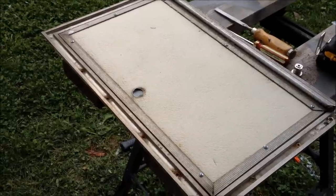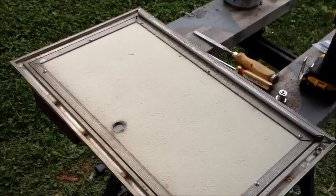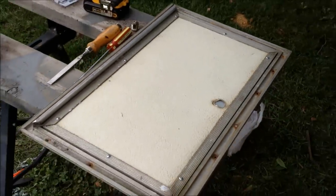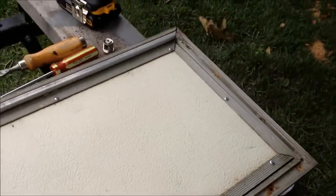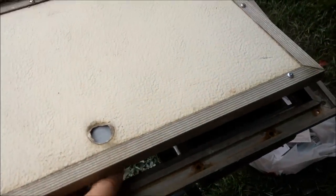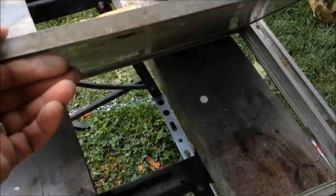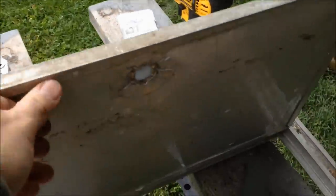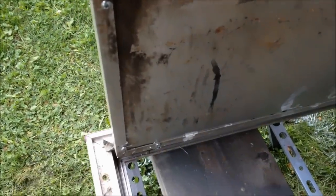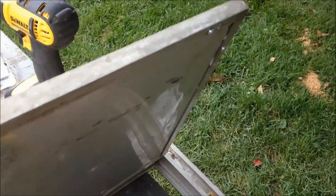I have the door all reassembled. The new piece of plywood is sandwiched in, and the frame is fastened to it. So far, looking pretty good — nice and strong. What I'm going to be doing now is putting the lock in. I had to go out and buy a new lock, which will be going in the existing hole. I just have to drill a new hole into the new plywood. As you can see, the door is nice and fastened. I glued it as well as put some machine screws around the perimeter of the framing, just to make sure everything is held nice and tight.